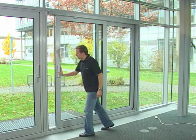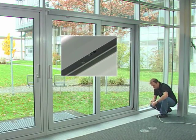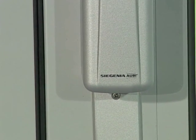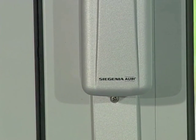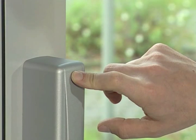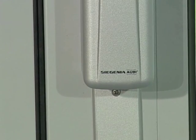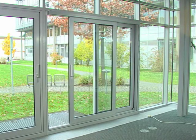After assembly of the MHS400 is completed, first carry out a reference run. For this, the sash should be in the closed position. Touch the button briefly and wait until the drive comes to a standstill. To teach the drive, hold the button pressed until the horn sounds 4 times. Now release the button and press it again until the horn sounds 1. After opening and closing twice, the MHS400 is ready for normal electric motor operation.